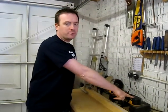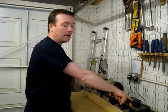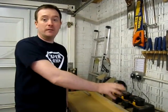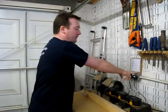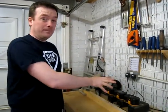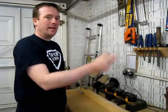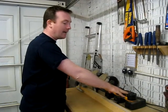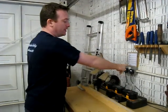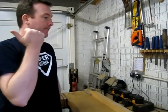The only problem is the nickel cadmium batteries as opposed to lithium ion. Lithium ion is lighter and holds its charge better. The nickel cadmium ones tend to discharge themselves if left alone, especially in a cold environment. This plug socket is wired to the ring main so when the workshop is isolated these are off. Not much of a problem because I've got six batteries — it only takes five or ten minutes to get sufficient charge, use a battery, come back, and the next one has enough charge.